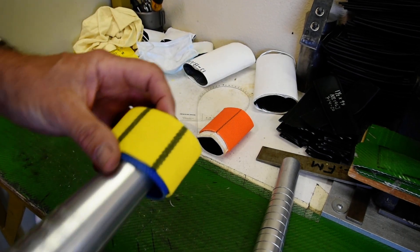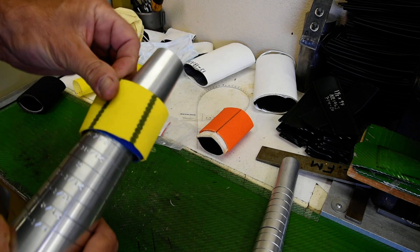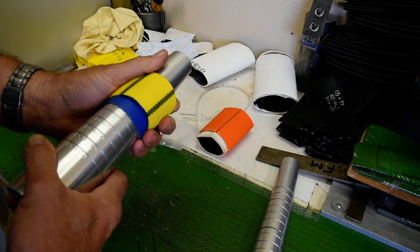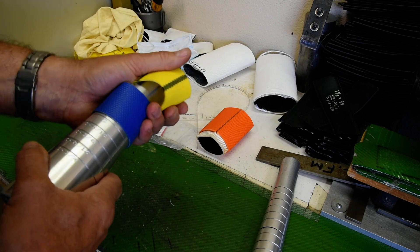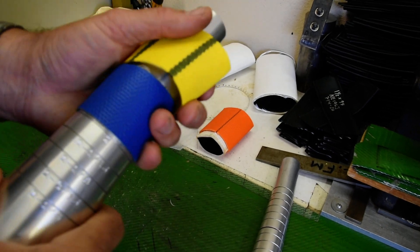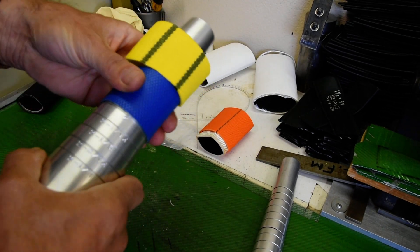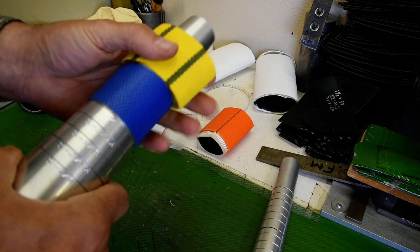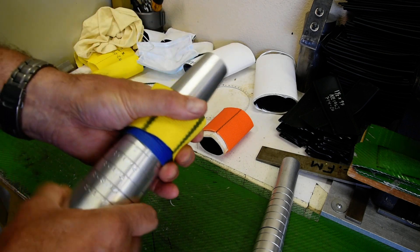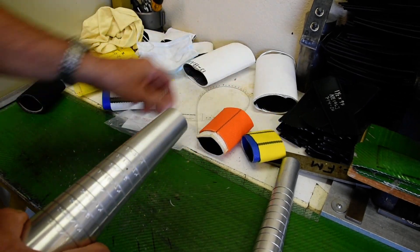Another manufacturer also has a very thin nitrile liner. We slide that down on the mandrel and it goes way past the reference dot — this particular instrument is calibrated and it's almost two inches, very very close. Keep in mind both of those measurements are without water pressure, and water pressure will dilate those further.